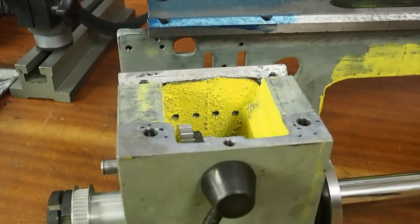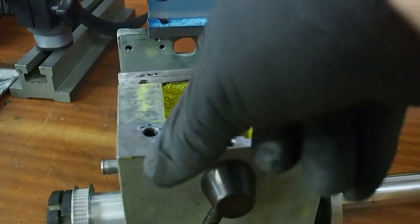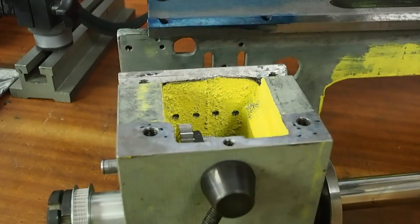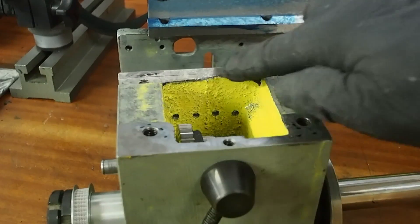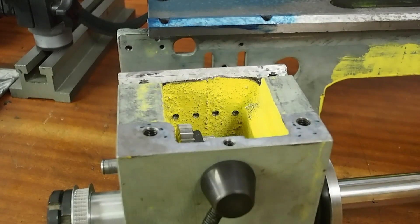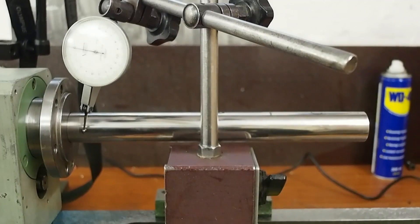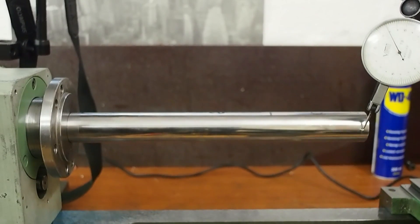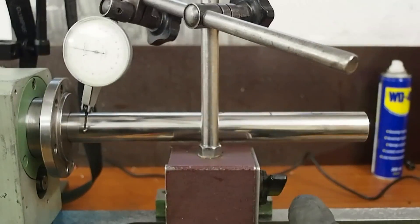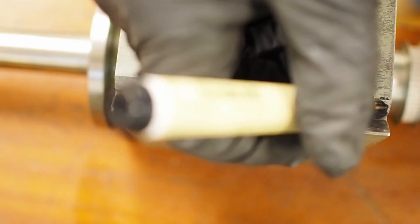When I first did the initial alignment measurement, it was obviously sitting on this center section. So the next thing I need to do is mount the headstock back on the lathe, set up the dial test indicator again, and check what the horizontal alignment actually looks like now that it's sitting in the V-ways properly. Now that I've taken that center section out, it's actually got worse horizontally — I'm now looking at about 30 ten-thousandths of an inch deviation, and I'm aiming for two.